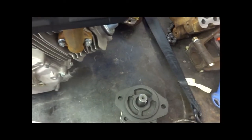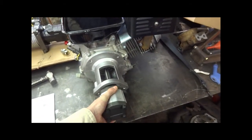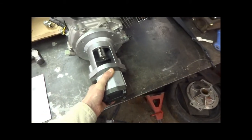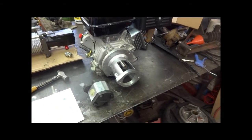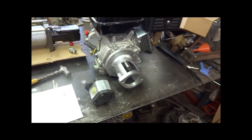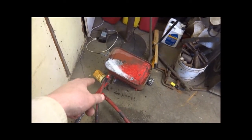So that is now going to be coupled to the motor like that, and then that will bolt on like that. This pump will put out a little bit more — about five gallons per minute. I didn't want to be shy, so I have lots of horsepower. And then I've got a seven-gallon hydraulic reservoir that I salvaged, which I'm going to use as the reservoir — it's got a filter base on it.